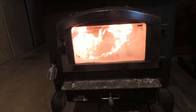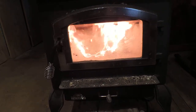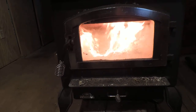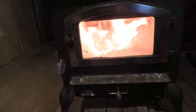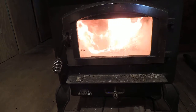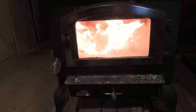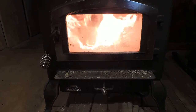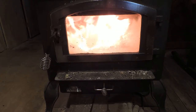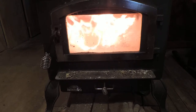This will do its thing for the next hour or so, releasing all those chemicals. I'm not really worried about the fans blowing because neither of these fans come in contact with the exhaust coming out of the stove — it's recirculating room air, two separate systems. So no chemicals are blowing into the house; it's all contained in the firebox and going right up the chimney. The blower fans are just moving room air to add convection heat as well as radiant heat. However, if you have an open fireplace you should keep your glass doors shut and make sure there are no other fans — you want all these chemicals going up the chimney, not into the room where anyone would breathe them.